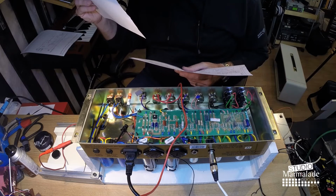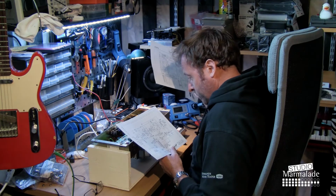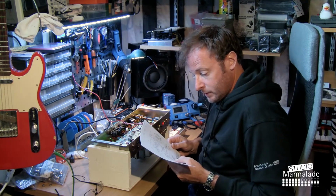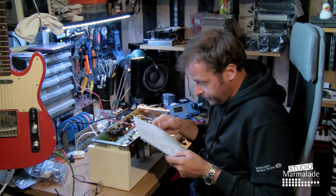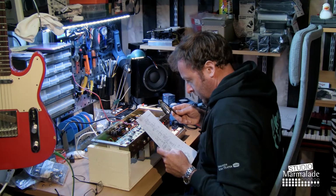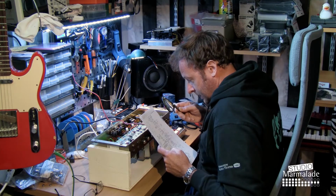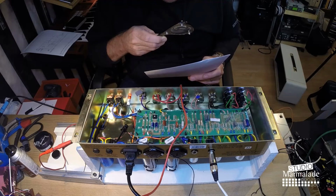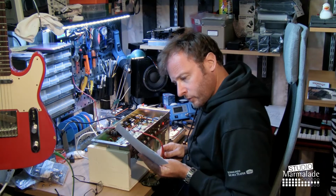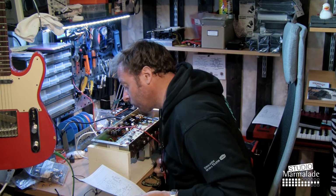It is a shame that they have not put the voltages in the chart like Fender do most of the time. I am getting very different readings on the first and second cathode of the first preamp tube. And it should be an 820 ohm resistor on both ones there. And it makes no sense that these two should differ that much, unless there is something wrong with either resistor or one of the capacitors, C1 or C2. Because apart from the resistors there, which should be 820 ohm, both of them,